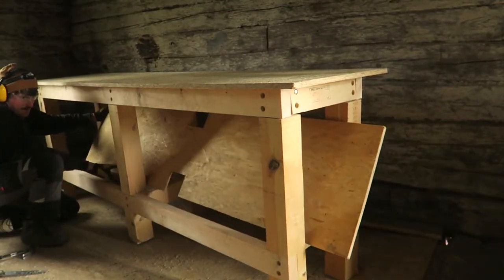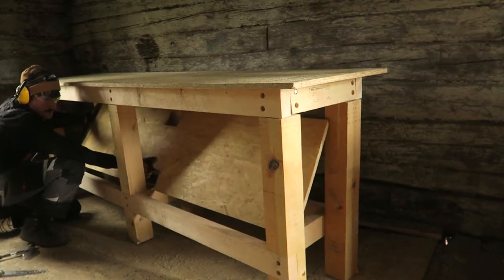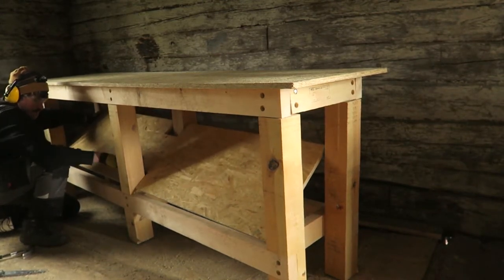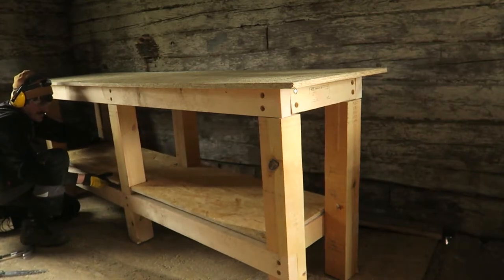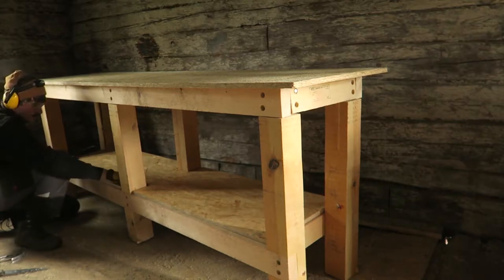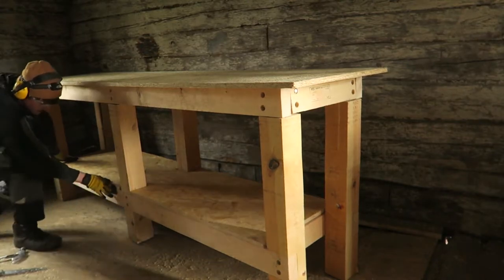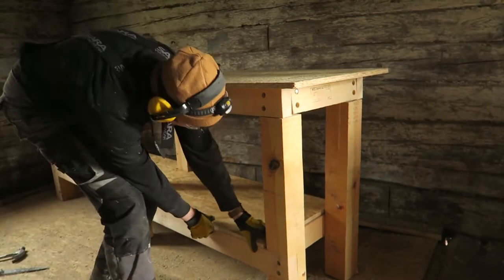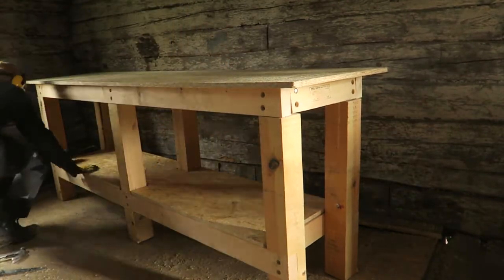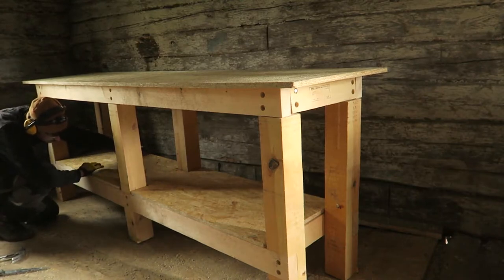So the vertical posts here, they're 100 by 100 millimeters. The horizontal ones are all 50 by 100 millimeters, which more or less is like 4x4s for the uprights and 2x4s for the horizontals. It's nothing complicated, you know. I cut out little recesses for the horizontal ones, and I also fitted them with lag bolts.